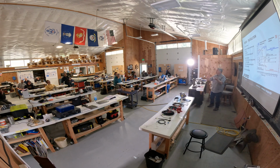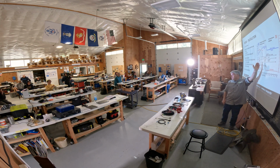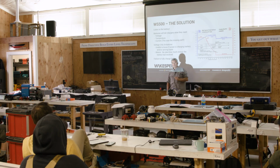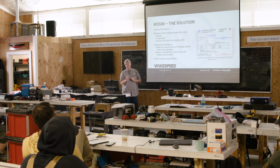It's causal. We have the voltage providing the push. You know, we're saying, here's more food, eat it. And the battery's saying, nah, I'm kind of full. I don't want to eat this much. So as it gets fuller and fuller, and this is where you've got to get the PhDs in the room to talk about what's really happening at a chemistry level, as the opportunity for a chemical reaction to happen diminishes at a certain potential applied to the battery, the acceptance current will be lower. Acceptance current, you can call it. Some people call it tail current. The real key is this point right here. When you've reached that 1 to 3% of battery capacity, and every battery manufacturer is different, which by the way is why the Wakespeed has to know how many amp hours of battery you have, so we can calculate that, that's when the batteries are telling you, I'm full.